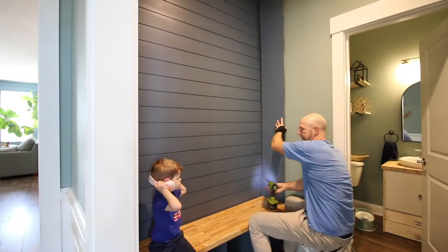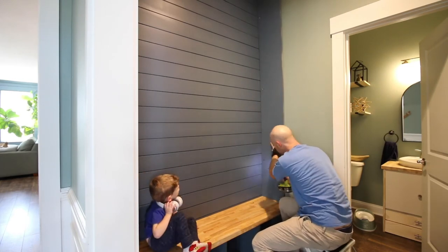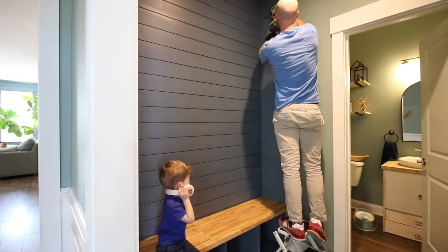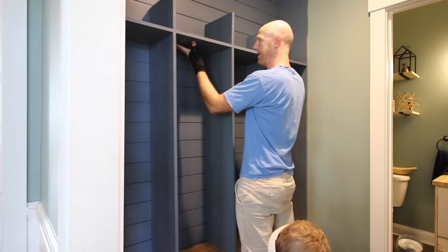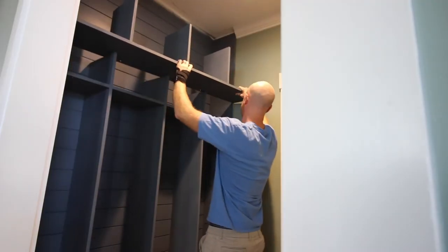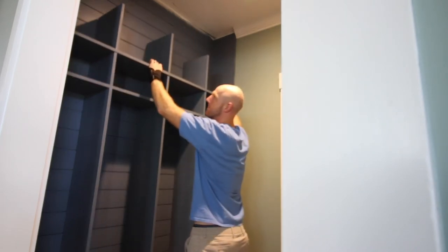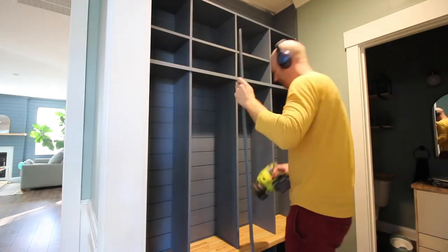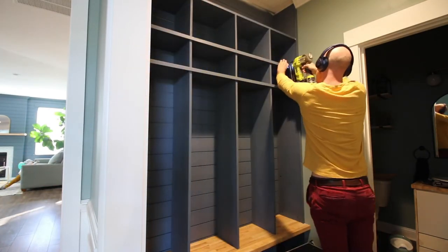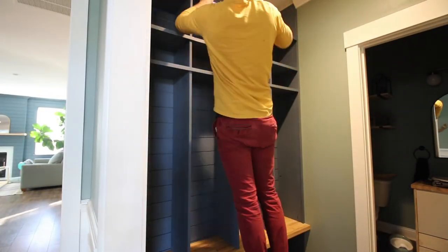We put the bench in and then started to build the rest of the assembly. We put boards against each of the walls to anchor everything in so everything has a stable place to be. We slid in the locker dividers and then the upper storage cubbies. Everything is super tight. We have woodworking plans available for this and you will see all the measurements. Rounding out the installation was the hardwood trim — we didn't want the plywood edge showing, so we cut some strips and nailed them in.